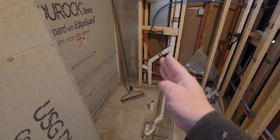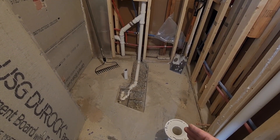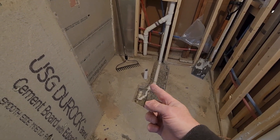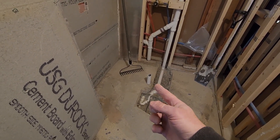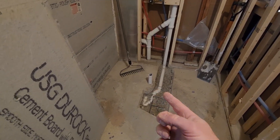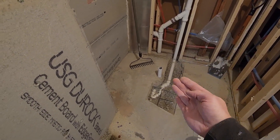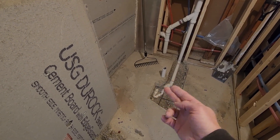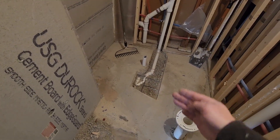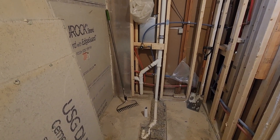The reason why is: if we're using the laundry over here and somebody flushes the toilet at the same time, it's going to pull the air out of the trap underneath the concrete. Once it pulls out the water, you're going to start smelling sewer. So with this vent pipe, if you flush the toilet, it's going to pull air from here instead of from the trap. The trap stays filled with water, and there's always air available — so that was done this morning and everything is good to go.